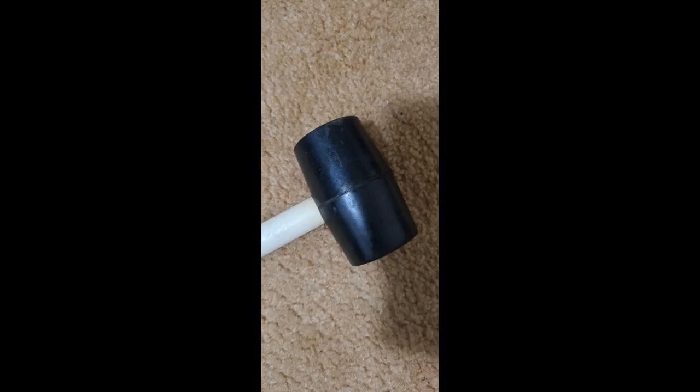If yours have no rust, then you may not need this. Prior to inserting the new pad, spray some silicone lubricant into the pocket. Do not let the new insert turn sideways when putting it in — it must be inserted evenly. On most of them, I was able to insert it part way, then used my hands to press it in as far as possible. Once it was mostly in but even, I drove it home with a rubber mallet. Take your time and give yourself a chance to develop your own technique. Once you do, you can make decent time on the project. I installed 32 of these on 8 chairs in about 40 minutes.